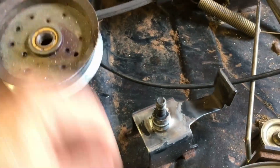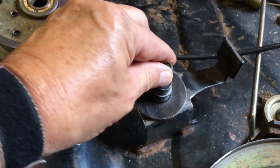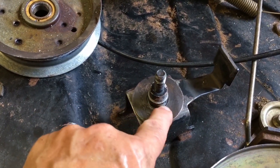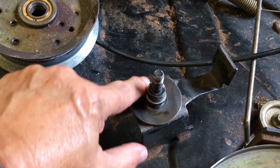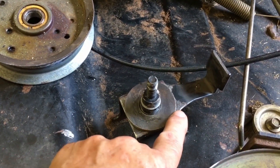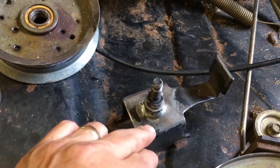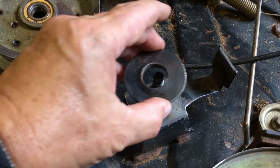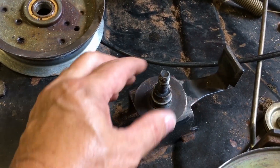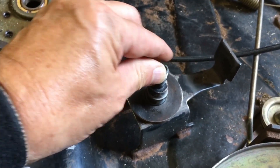So to fix it, what I'm going to do — I got a big thick washer. I'm going to put it down on that, straighten this up, then I'm going to weld it. This little bottom part is all metal. So I'm going to weld it all around there and then tack it or weld it to this frame piece or deck piece. I've wire brushed it to where it's pretty smooth, a good weldable surface. I'm going to weld this to that, and hopefully that will keep this from rocking — otherwise it's going to break off. And what it was doing, like I say, is burning my belt up.